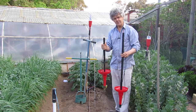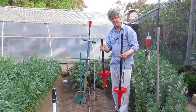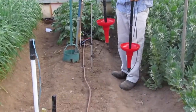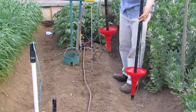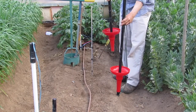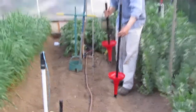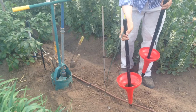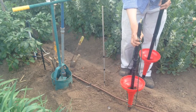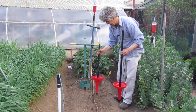The depth you place them is really important — we'll deal with that in another video — and so is the placement. For example, if you are furrow irrigating and the water is just coming down a furrow, you need to place your detector on the edge of the bed so the water infiltrates dead above it. If you're irrigating with a drip line, you need your detector to be right underneath the dripper so the water is infiltrating exactly above your wetting front detector.